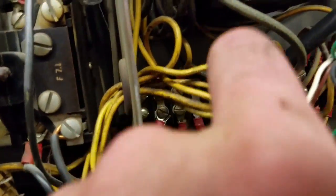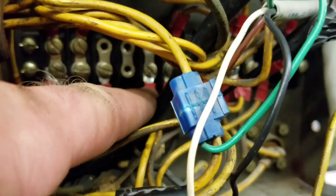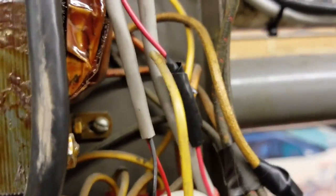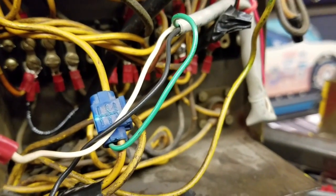Every time I run the oiler down there, you can hear click click, like it cycles the machine, but the machine's not on, so it doesn't move. But so that's what I did. Put that over there, scoring and the triggering, I mean, and then on 5 I put the on-off switch. So now it looks a little bit better. I do believe that's all that I need to do, except for hook these black and white wires back up, and the white one goes on TS2 7 and the black one goes on TS2 6. So I'm gonna hook those up right now, and then we'll fire it up.